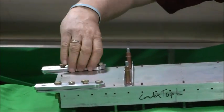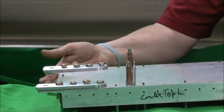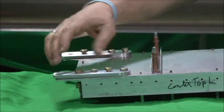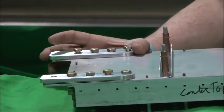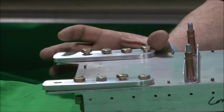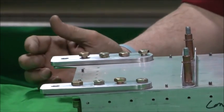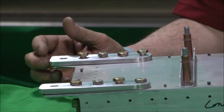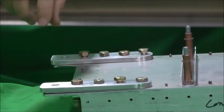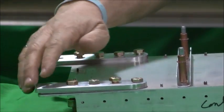Fittings are in place. Nothing's tightened down yet. You can see we've got a full-size hole, the 3/8 hole through the spar fittings on this airplane. If you receive fittings from us or in your kit, of course in your kit the spar is all pre-assembled, everything's been together, so the dihedral's set. But normally we'll show on the plans a 1/4 inch hole out here where the wing attach bolt is. That's just for alignment only.